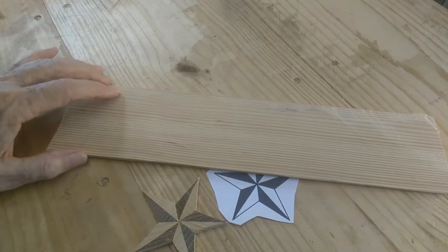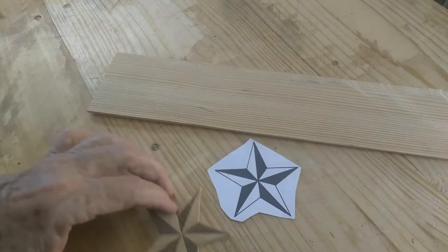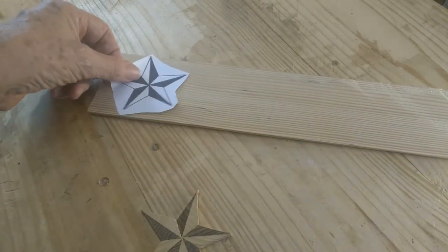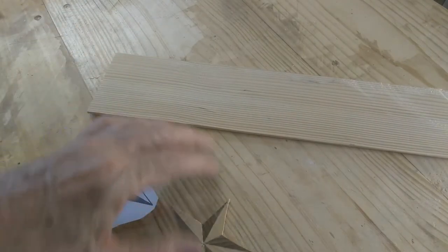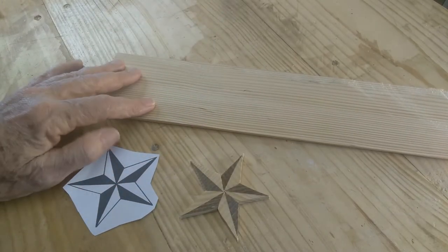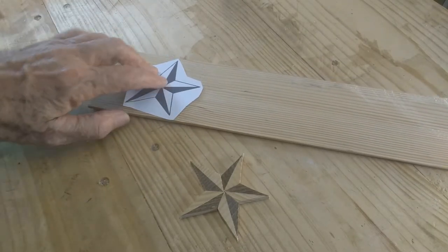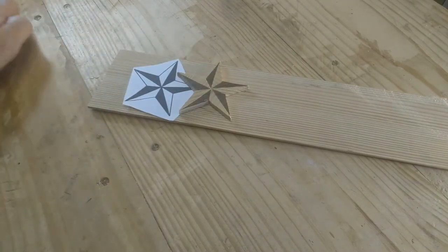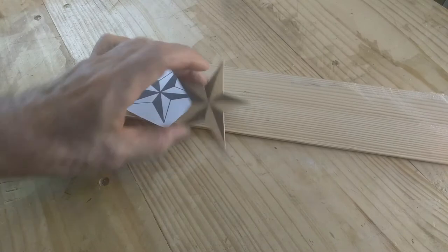This was like a one-by before. So what I'm going to do with this — I've got this pattern and I'm going to cut two pieces the size of that pattern. Then I'm going to stain one of them. As you can see, I've got a dark and a light section. I'll stack them, mount this pattern on it, cut each one of those sections, and then flip the dark and the white halves so I'll have an image and a mirror image of that.